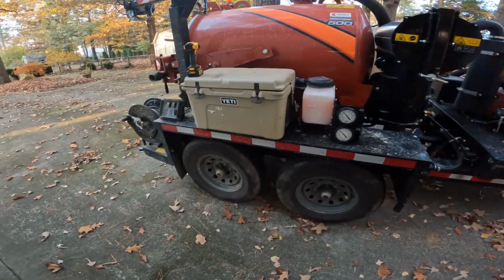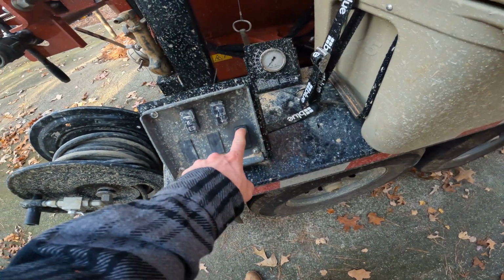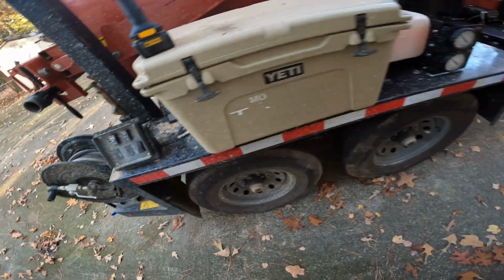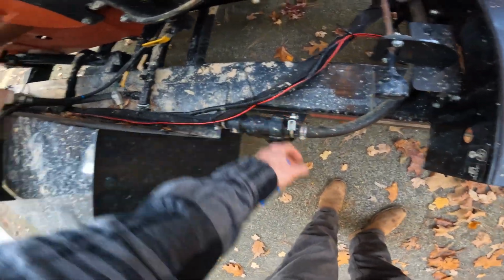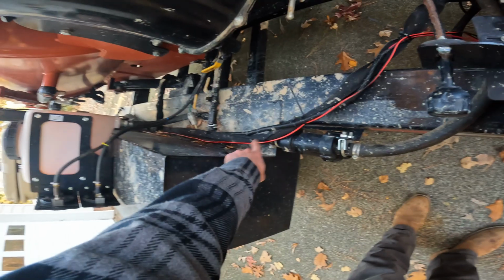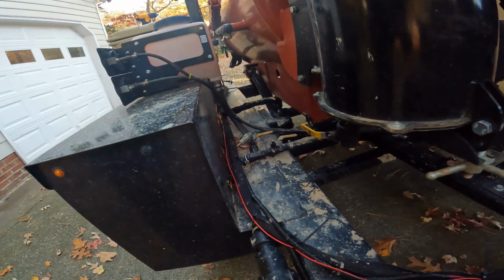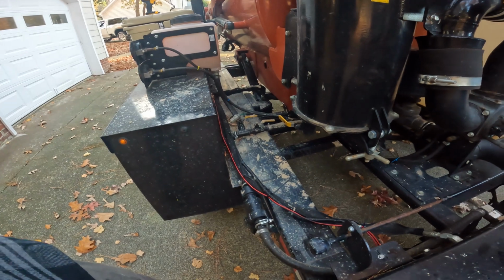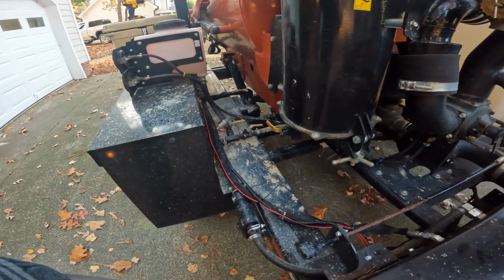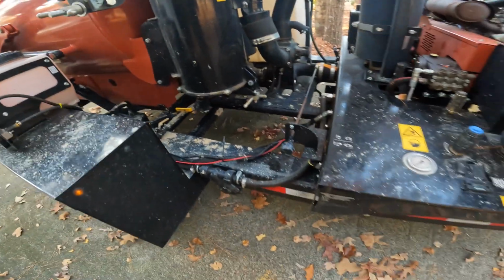Now we've got all our wires tucked away and all the connections made. Got our switch here at the back now. And then it runs up here. I haven't put it in any type of loom. I think I'm actually gonna run a piece of conduit down this rail or maybe inside this rail for all these wires, because I've already added 4 different wires coming from the back to the front. So maybe a piece of conduit will be a little more beneficial in the long run, but I can always go back and add some loom after I run that through there.